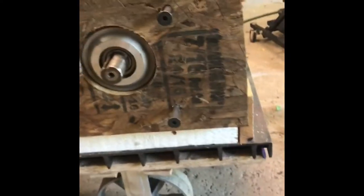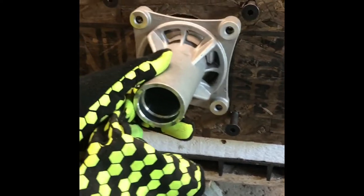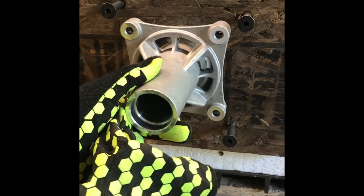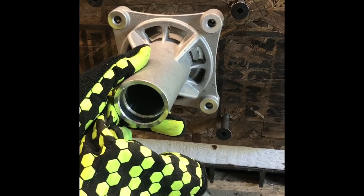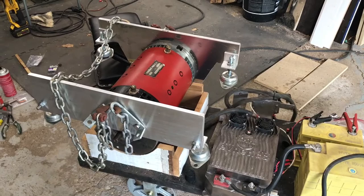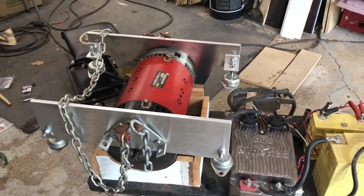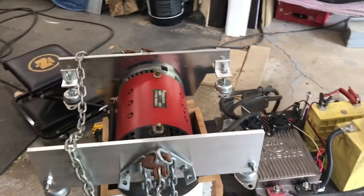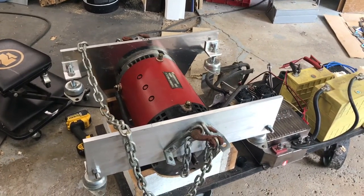It will look like this, and this will also be bolted to the front of it. The thrust bearing will go on the end of this piece to transfer the thrust from the prop to the hull. The brackets are all drilled, cut, and mounted, and I've got a chain mounted to help me hoist the thing into the boat — it is kind of heavy.